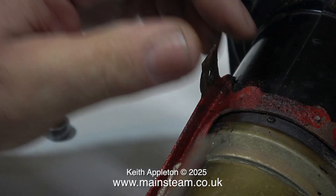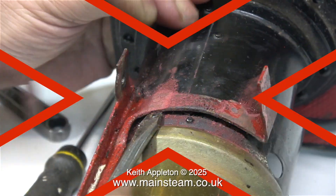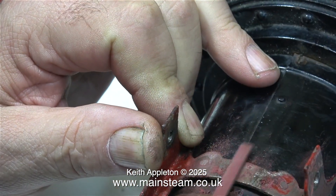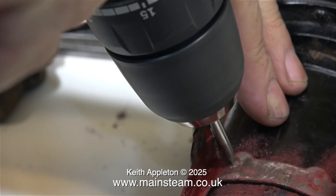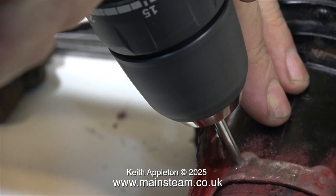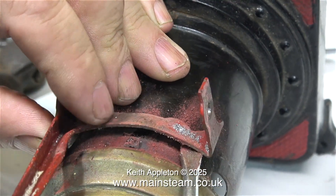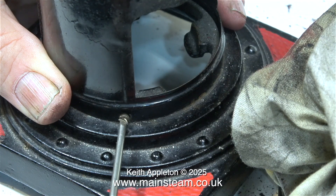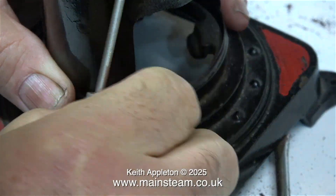When I get them flat enough I'm going to drill them out with a small drill. This job takes a while and a bit of patience is definitely required. Even though the steel bracket is very loose, under no circumstances must you force it. What I need to do is further weaken the rivets before I can drill them out, so a bit more needle filing is in order, followed by using a centre drill in my small Bosch electric drill. The initial idea is to weaken the rivet as much as possible. That's one down and one to go. Now using a screwdriver to very, very gently prise it off, I can clearly see what the problem is — over the years these two mounting holes in the firebox area have become enlarged and distorted, and that coupled with the fact that the firebox area is a bit dented and uneven around the edges means that it needs a bit of major surgery.